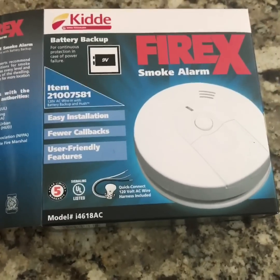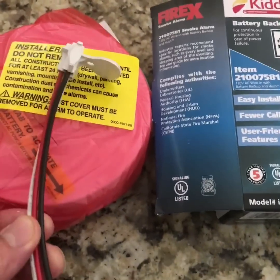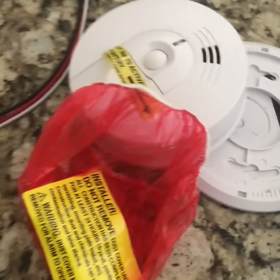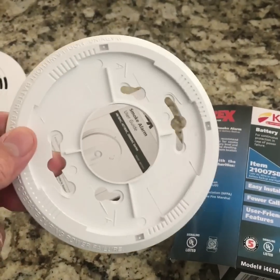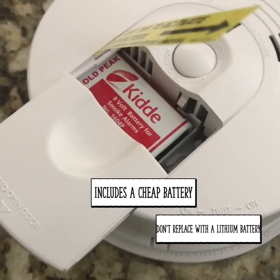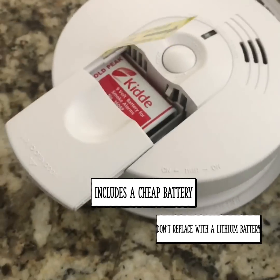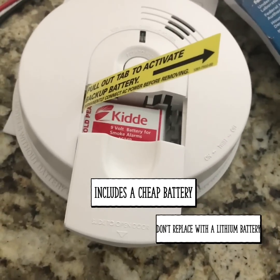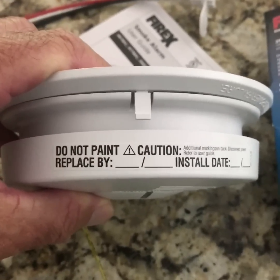This is the unit I've chosen — it's the Kidde, formerly Firex, and it comes with a pigtail connector, the smoke detector itself, and a new base plate. Keep the little dust bag on if you're doing any drywalling or if dust is present; otherwise you can remove it. It comes with a nine-volt battery, though it's not a lithium battery so it probably won't last a year. To activate it, pull out the tab after installation. There's also an indicator to show your install date and remind you when to replace it.